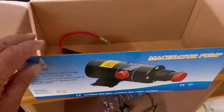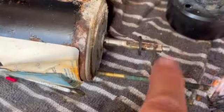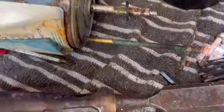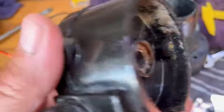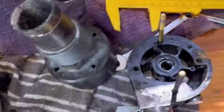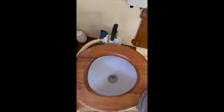Forget about it — I got a new one. I did try to repair it: I pulled it apart and replaced the impeller, but then one of the studs broke off and I found a lot of corrosion due to a leak from the seal. So I said, well, what else is going to go wrong? I decided it wasn't worth it, threw it away, and got a new one. Toilet working — job done. No more toilet for today.